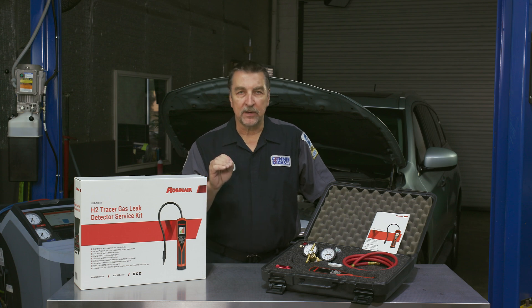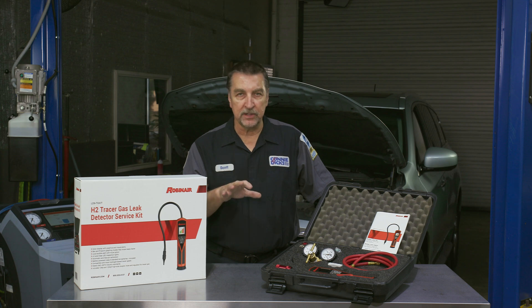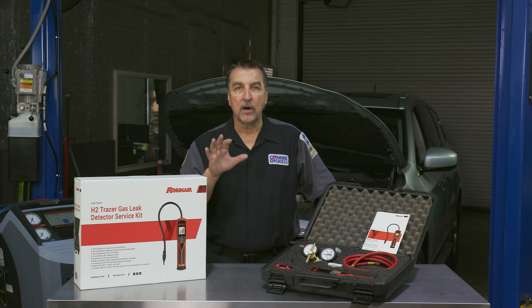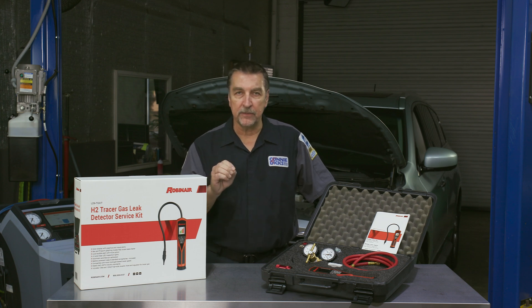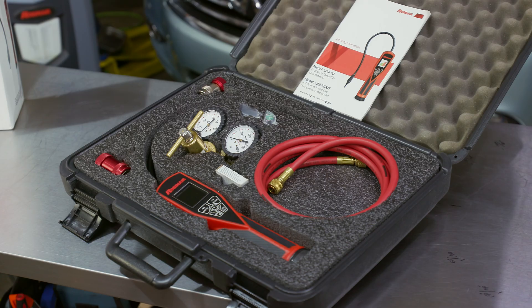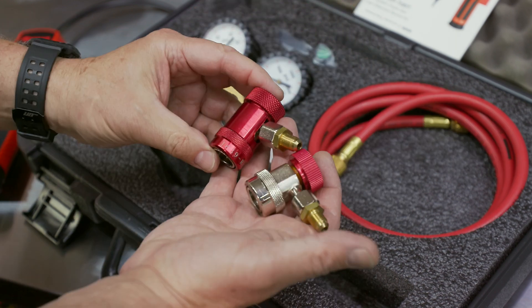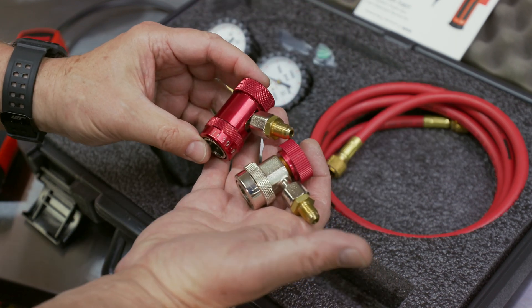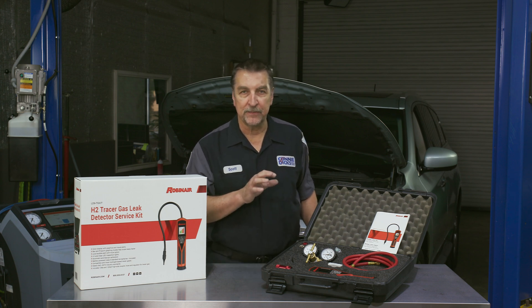To get even more technical, this complies with SAE standard J2970 sections 7.2 and 7.3, and also complies with European standards EN 35422 and EN 14624. The following components come in a nice blow-molded storage case: a pressure regulator, a hose, R134a and 1234yf quick connectors — allowing one to easily pressurize an empty system up to 100 psi.